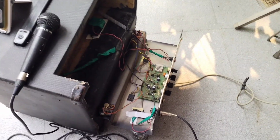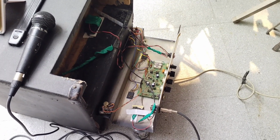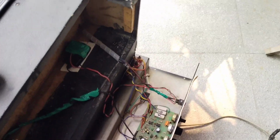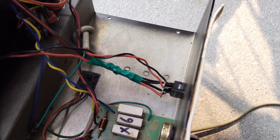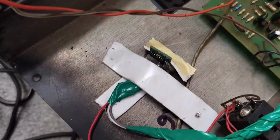So as I said yesterday, I have soldered everything in place. So I'll go in the logical sequence and show you the wiring. So this here is the switch which, when turned on, supplies the power to the transformer inside the speaker cabinet, and also this adapter which supplies 5 volt 400 milliamps. So the output of this wall adapter, which is 5 volt DC, I have fed into the input of this Bluetooth module using this cable here, and I've folded the cables neatly.